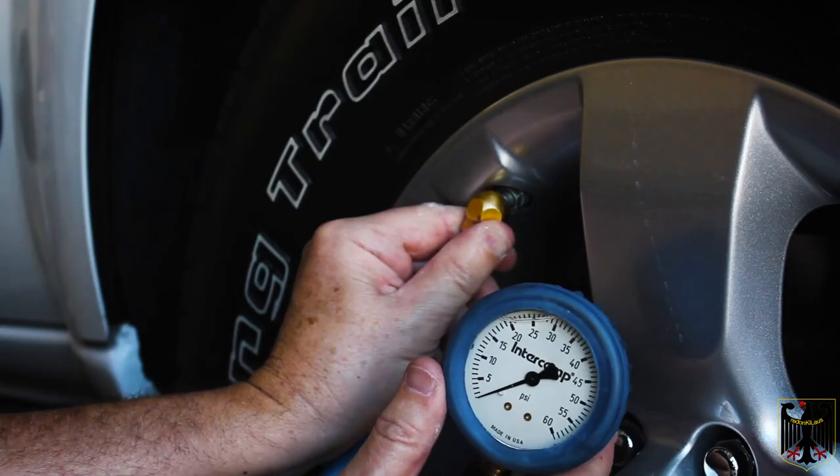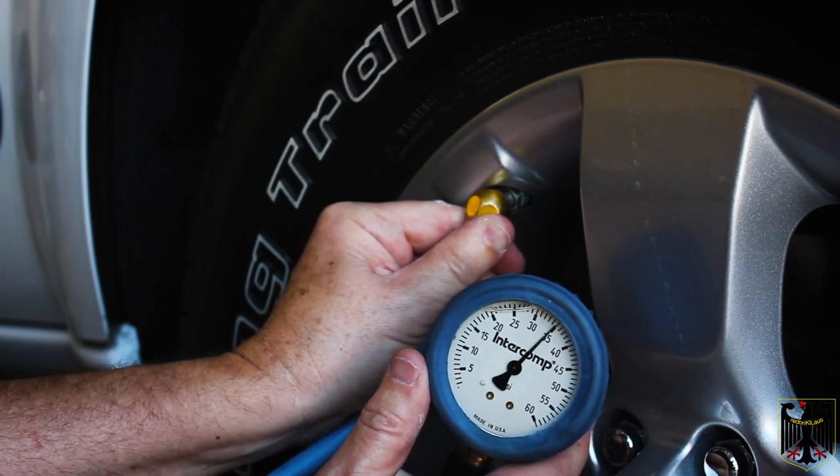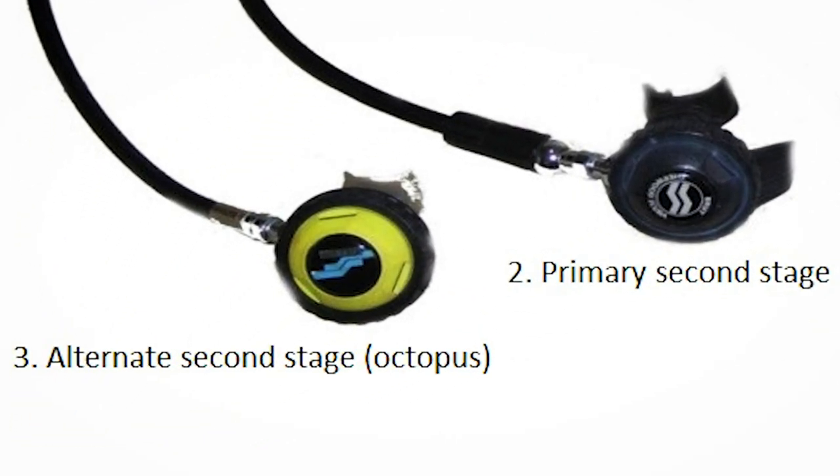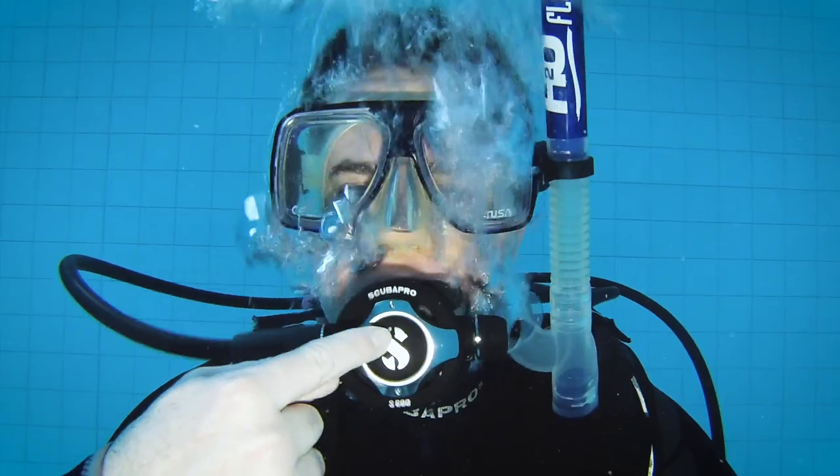The next element in hard equipment is your regulator. If you consider that your car tire has two bar of pressure, then 200 bar of pressure in your cylinder is a very high pressure. The first element in your regulator is called the first stage, and it's there to take the high pressure from your cylinder from 200 bar to around 10 bar above ambient pressure — we refer to that as low pressure. That low pressure is then delivered to you through the second stage, which takes the air from around 10 bar above ambient and delivers it on demand. As you breathe in the valve opens and delivers air; as you breathe out the valve closes so that you can expel the air. The second stage also has a purge valve on the front — if you press that purge button it'll open the valve and deliver a continuous flow of air.